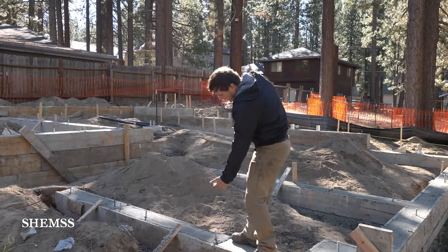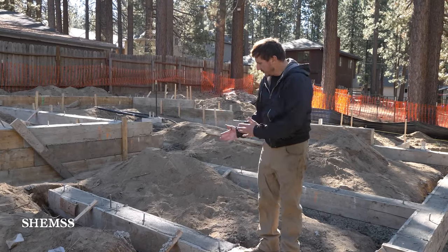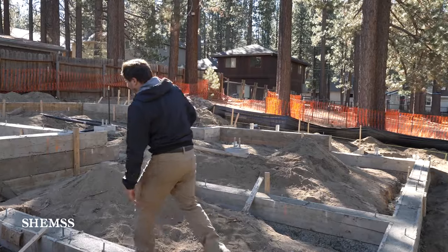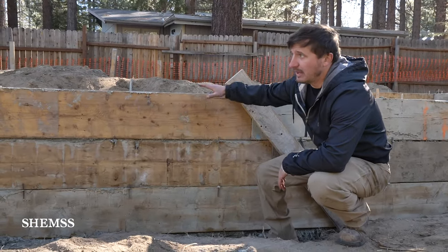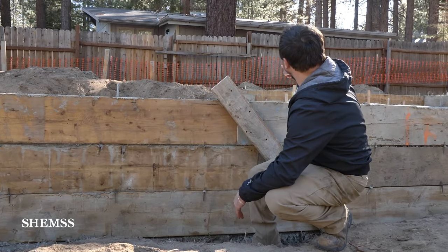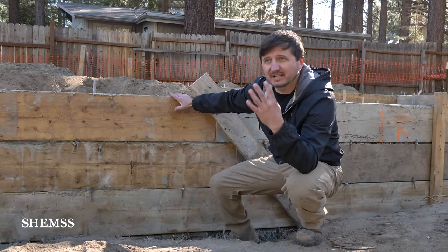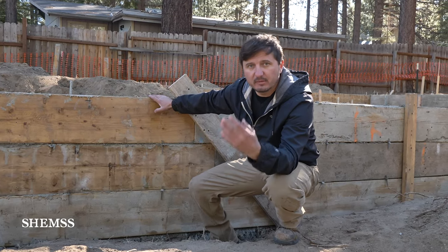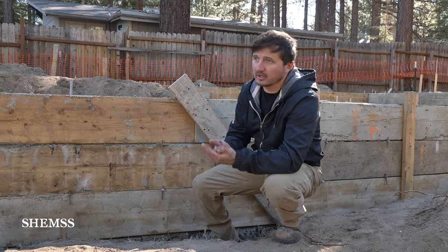As long as we have 8 inches, 6 inches from ground, I can build the pony walls. I don't need to raise it. And another thing, I'll tell you this. Watch. 1, 2, 3. Approximately 3 feet, right? So what I'm trying to explain to you, if I continue one more board, it's 4 feet. 4 feet is considered a retaining wall. Retaining wall, it's more rebar. So the higher you go, the more rebar you put, more concrete you put, more money you put. Okay, makes sense.